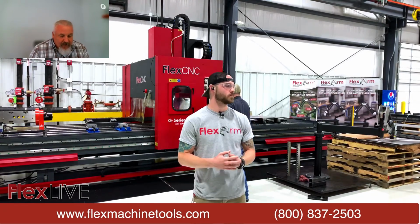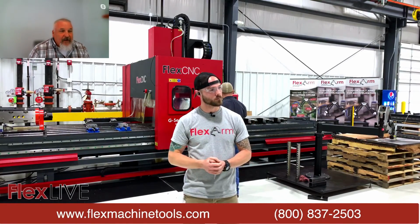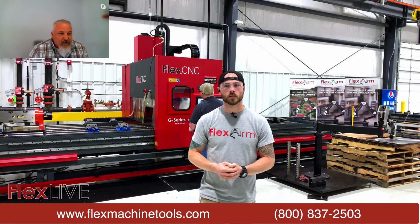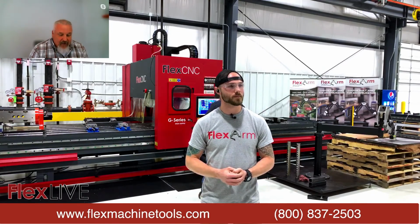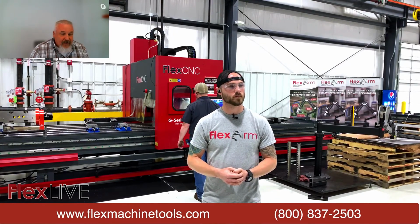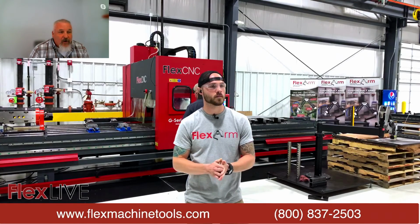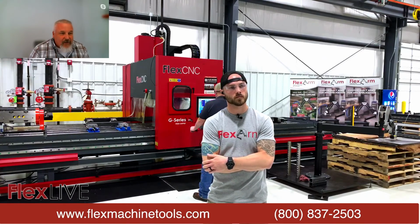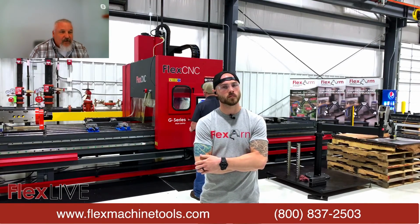Yeah, absolutely. The neat thing about the flow drill process and its applications is it fits anybody, anywhere. I mean, we're not subject to just one specific industry. We work with the automotive guys from the big three to their supply chain. We work with agricultural, making hay rakes, tractor cabs, mowers. We're heavily into the ATV industry. They use a lot of that flow drilling for the frames. All ATV side-by-sides from the John Deere Gator to Polaris to Kawasaki, Honda. A lot of that industry is very, very strong with the flow drill at this point.